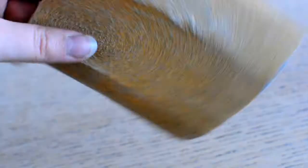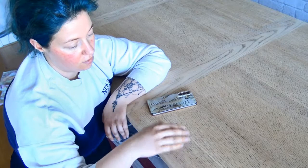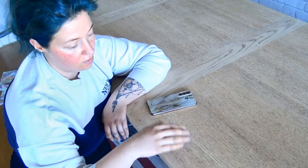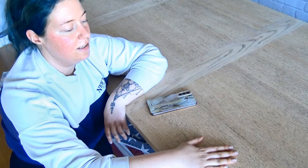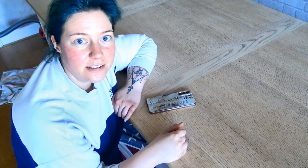I'm getting to a point where I'm starting to be very pleased with the finish. I've gone over with finer sandpaper — 150 grit and 240 grit. Using those grits actually starts to remove some of the stain because all of the surface details are getting flatter, making it easier for the sandpaper to reach the stain. Honestly, if I don't get rid of much more stain than what's already there, I actually don't mind — the table looks very beautiful as it is. We can finally start painting the rest of it.